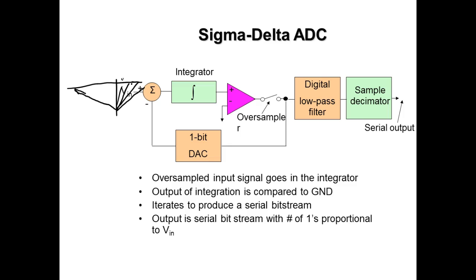That's the problem with most A to D converters. If I was to put a decimal number up here and say convert that to binary, how many could do that in their head? So digital analog conversion takes time. And that's what they call the sample rate. How fast can the converter take an analog input and convert it over to a digital value? Yeah. So these guys are pretty neat.